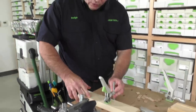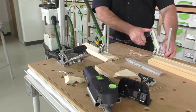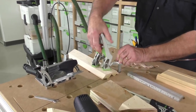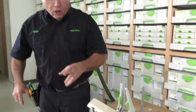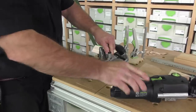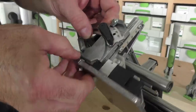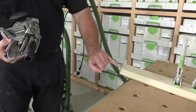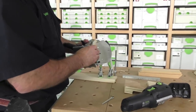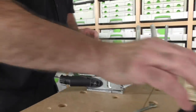By the way, hopefully you notice this — did you see how I took the motor off of the fence? It makes finding bevels and angles so much easier because it's not back-heavy on the machine. I'm completely bottomed out — just going to verify that. I'm completely bottomed out. See that? See how that's touching there? That way, that mortise is going to be at the top. I'm always verifying just to make sure. Absolutely perfect. So I have that set up.